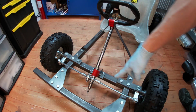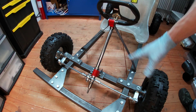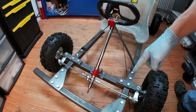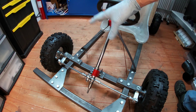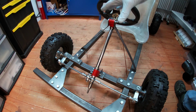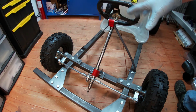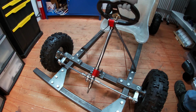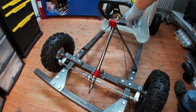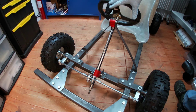The threaded rod is now installed on both sides with a lock nut on each end, so once everything's set for the final time that rod can't turn. To adjust it you unbolt one end and wind it in or out as needed. It's only set roughly by eye for now - when we give it a test, get some weight on it and let everything settle, we'll adjust as needed. But you can already see that's going to work quite nicely - steering is essentially done, just need to put the steering wheel and boss on properly.